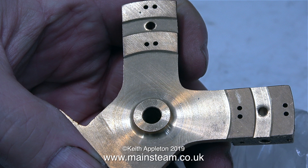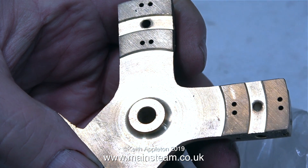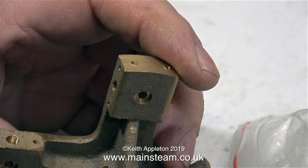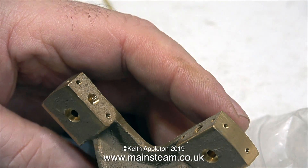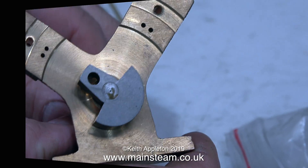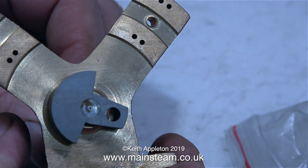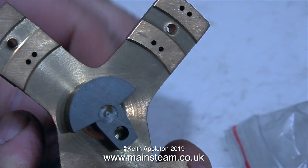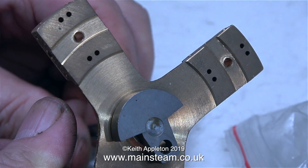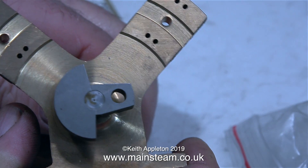The holes on the port faces of the standard need to line up perfectly with the holes on the port faces of the cylinders. Once the holes have been drilled — not all the way through — there are cross-drillings. These cross-drilled holes allow the steam ports to communicate with the outside world via the exhaust and inlet ports. On the pre-machined kit, the holes have been drilled accurately and threaded, ready to take some brass studding to block them off. The fit of the crankshaft into the main standard is perfection — not slack and not tight, just perfect.